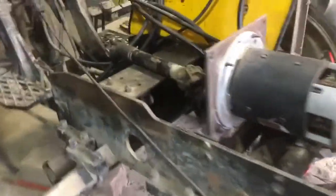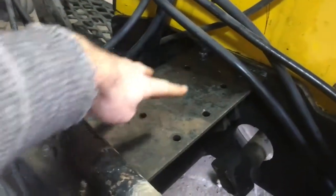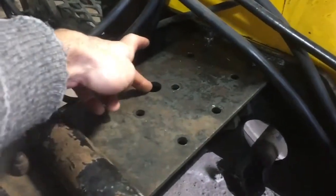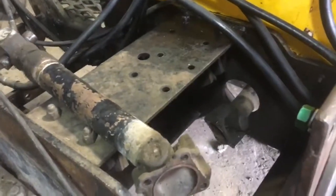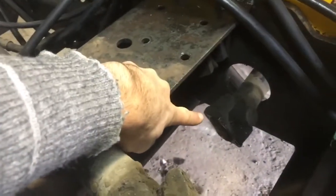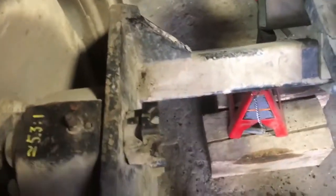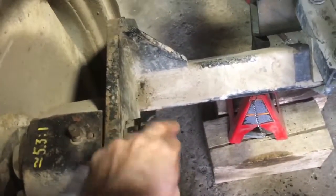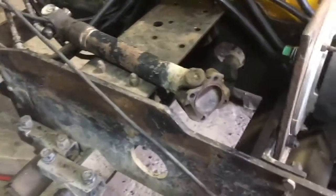This is the DIFF — I'll walk over to the tractor. The DIFF lives under this plate. It hangs from a quartet of bolts with spacers. There's access here for a breather, which I think also doubles as the filling plug. And then the DIFF drives these half shafts — one headed out to the final drive on that wheel, and the other one that I removed in the process. The half shafts are really cleverly made.